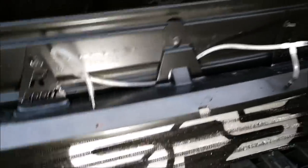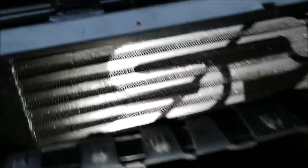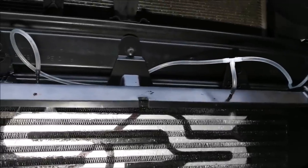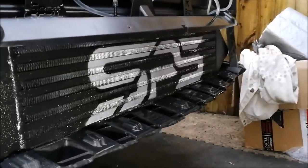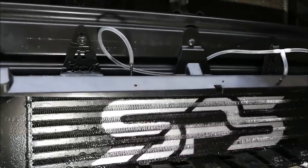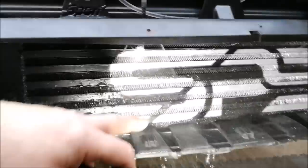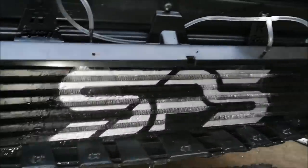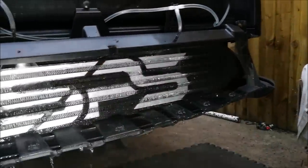So I've got both temporarily plumbed up to test the two locations. You can see the difference in the spray pattern — it's getting nice and wide down there, but it's not hitting the intercooler as thoroughly as the other one. With a bit of forward driving wind, that would give a nice spread on there actually. I think I'll go for the angled one just to be sure.